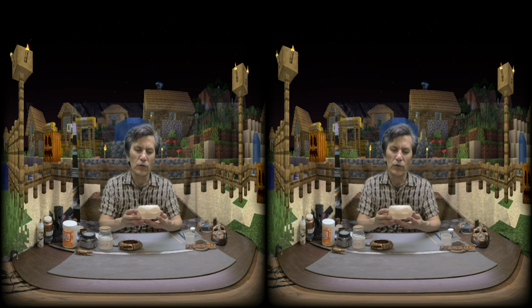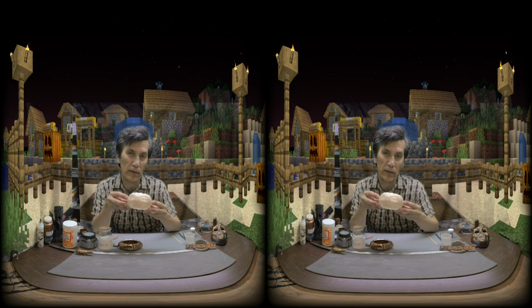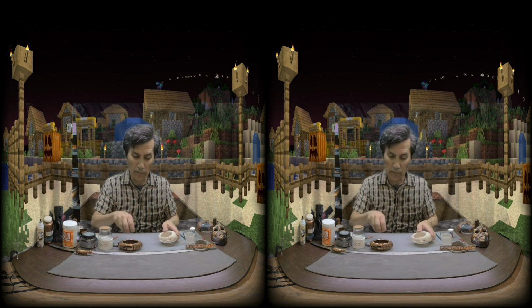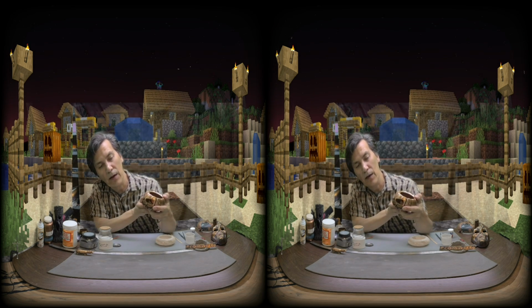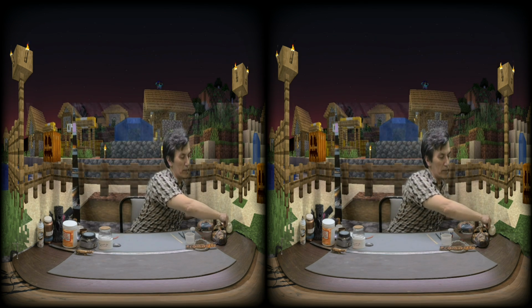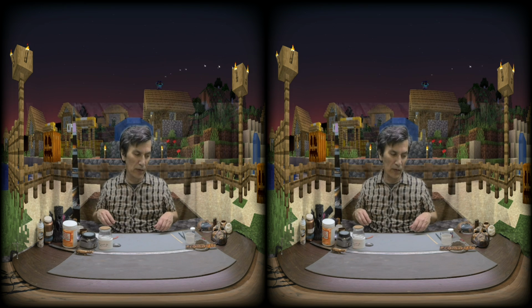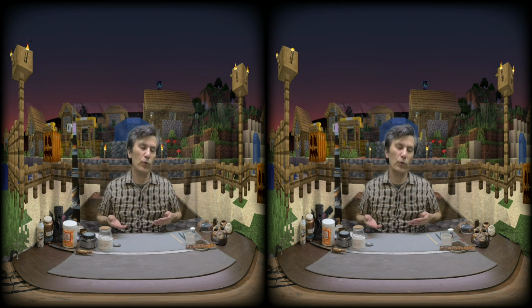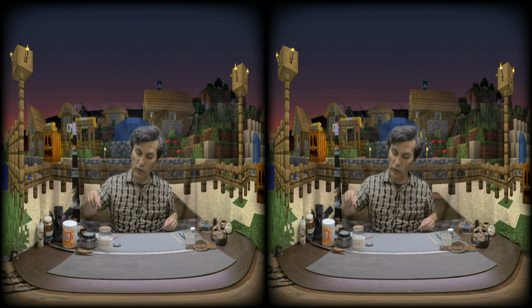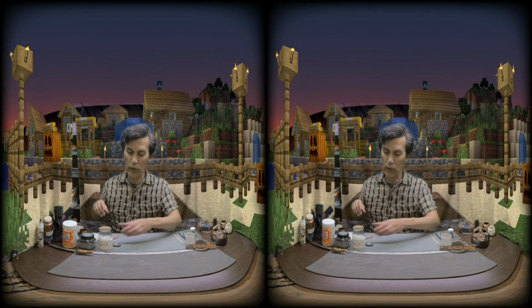You can use electroforming to transform a 3D object like this pumpkin here and convert it into a piece of copper like this, which I use as a key light. And the process to do this, basically you can put copper on anything, but you require the surface to be conductive. So what we're going to do today is make some conductive paint that will work really well.